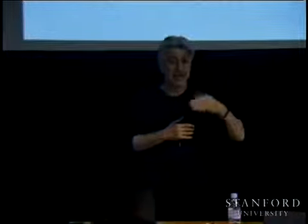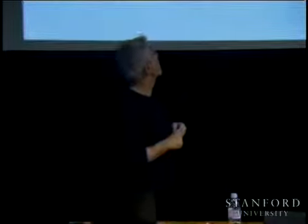Now, what we need to do is the frame assignment, and we are going to start by assigning origins and z-axes. In this case, we have a lot of things that are already there. So you see the first joint axis, the second one. What particularity about those axes do we have? Joint 1 and joint 2 are intersecting. So the intersection point is going to be an important point in this case.